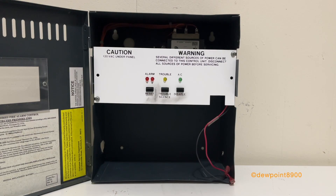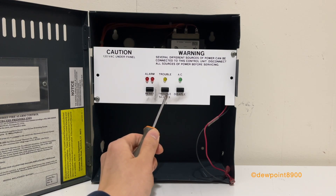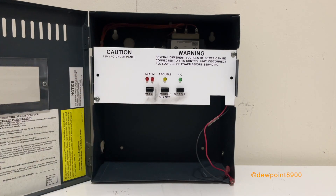The SGL-2000 has three operator buttons. The disable switch disables the signals and the initiating zones. The trouble button just silences the internal buzzer, and the reset button resets the system. Very simple and straightforward.